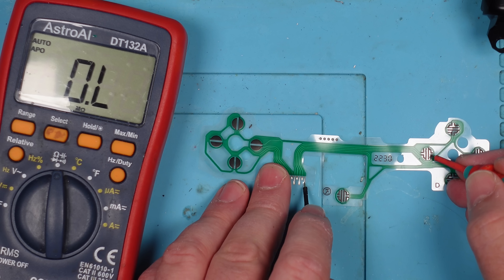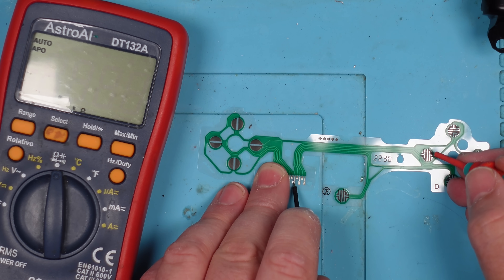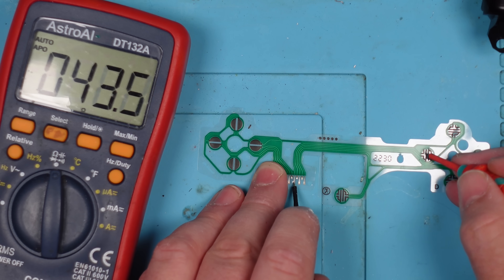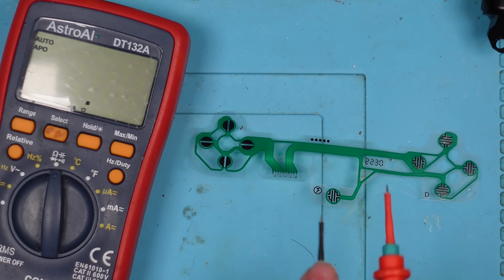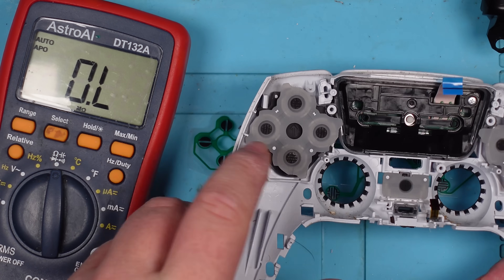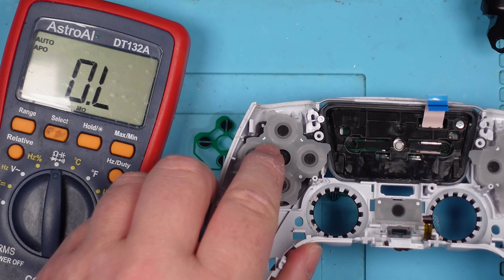Let's see if that one comes up over here as well — I'm guessing they're going to, because the first one did. 20 ohms. 21 ohms. 18 ohms. And 20 ohms. So they're all getting there from where the button presses are. So the problem must be on the board — either this contact point isn't making a good connection with the board, or there's something else wrong. Just to show you the pad here — these are the two buttons, and they're perfectly clean. There's nothing wrong with those.